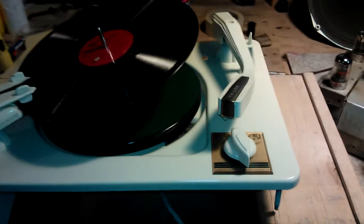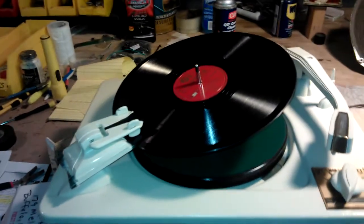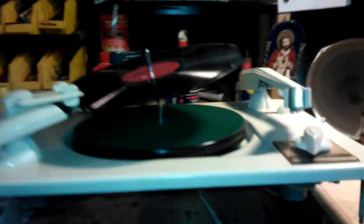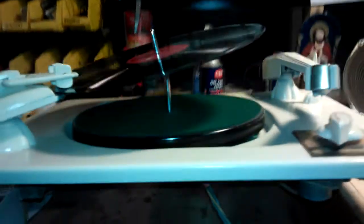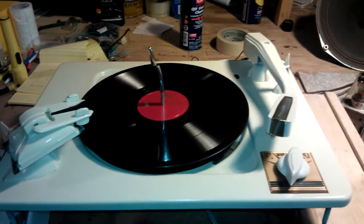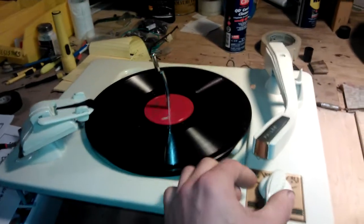I got it working. It just needs some adjustments. Let's see if I can get the record player to eject this record — it's a pretty neat mechanism. There's a sliding metal plate in here that pushes the record out, and it falls off the spindle. The spindle comes up straight and then angles to the left. The thing I haven't been able to do is get the arm to work properly — there's some kind of adjustment I need to work on, but I think it will work.